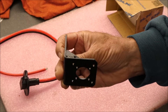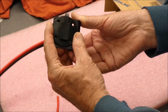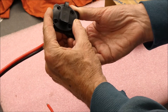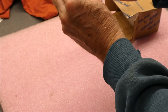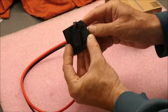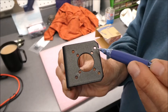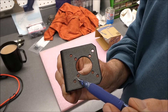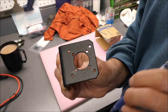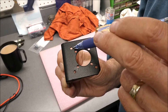This little bracket came in the mail today and it goes right on there. I just have to drill or elongate a few holes and I'll mount this on that gray box on the trailer — like so. I'll have my SAE connector on there. What I'm going to do is drill holes right in between these two holes in the four locations and then slot from the outer one in with a small file.